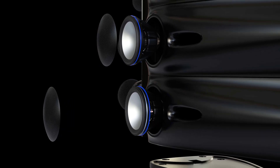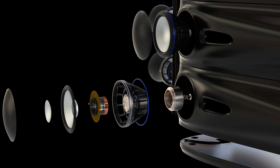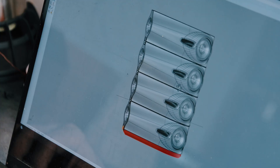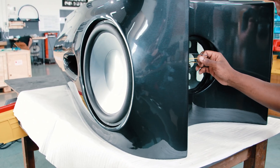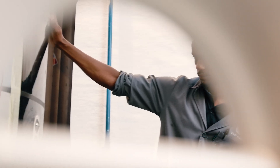Another question people might well ask is why we've chosen to stick with the C225 driver. Why didn't we develop a new one? Why not use 418s or 221s? Well, the point is that with eight C225s you've got eight hundred millimetre voice coils. By using this approach we've got huge power handling, much more magnet per driver, and of course being smaller the top end breakup frequencies are much further out of band. So all in all you end up with a more accurate bottom end by using this approach than having a small number of larger drivers.